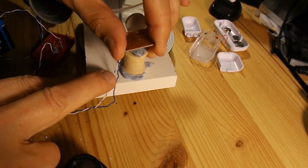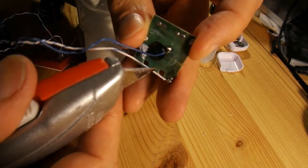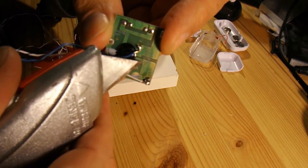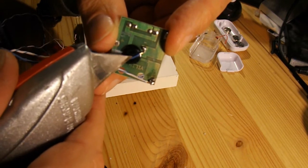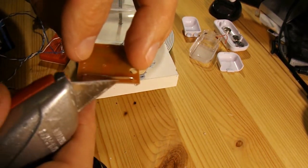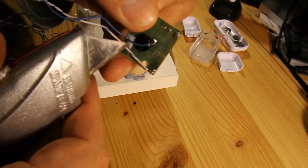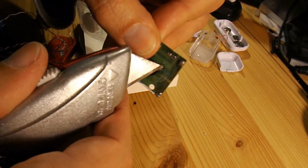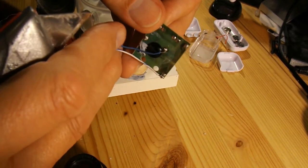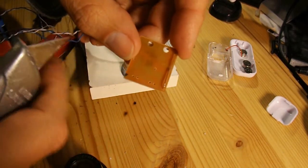One last little point — I did actually have to modify that circuit. When I say modify, I put a knife cut straight through that bit of circuitry there, just to totally disconnect whatever that black blob is from the reed switch. I've cut it off so I've got my circuit going to there and to there. In other words, there's nothing else left of the original light switch other than just the reed switch.